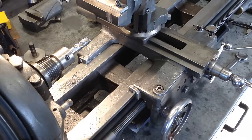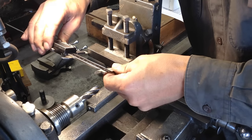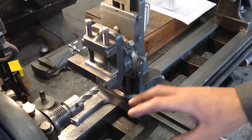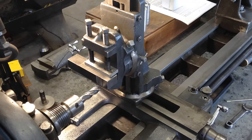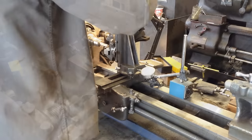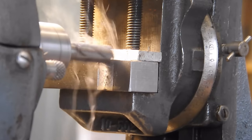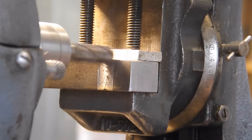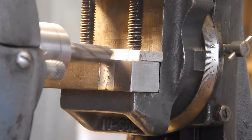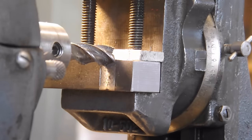And of course I had to move the light because that wasn't set up right. I thought I would take a little measurement and see if I'm in the right neighborhood. Now I need to figure out how to advance it enough that I know when I'm three-eighths of an inch in, which would be really handy to have this little carriage indicator done so I could figure that out. And right here — backlash. I didn't have the dial turned the right direction, forgot to take my backlash out, and it sure did jump on me.